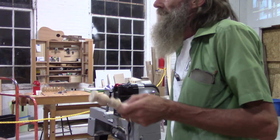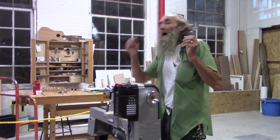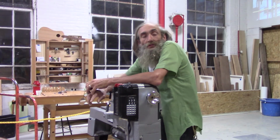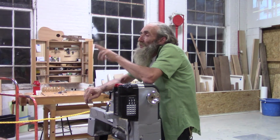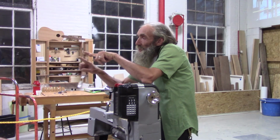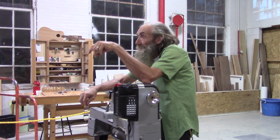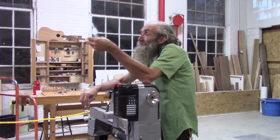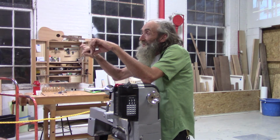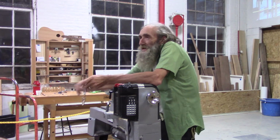Can you sandpaper the ring? Okay, if I was actually gonna cut those for a finished product, not the way this is, what I would do is, one, I'd sandpaper the top, I touch the top before I start the undercut. Once I've undercut and cleared away that bottom section underneath it, like on a goblet, if I'm doing a captive ring on a goblet or something like that, I take a piece of 220 sandpaper, wrap it around the stem, and just tape it in place, and then hold the ring and move it back and forth a few times. It's fairly simple.